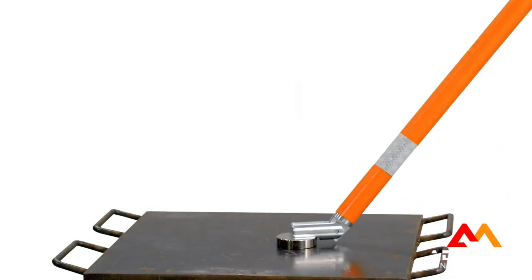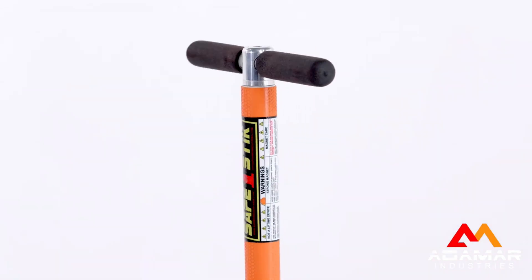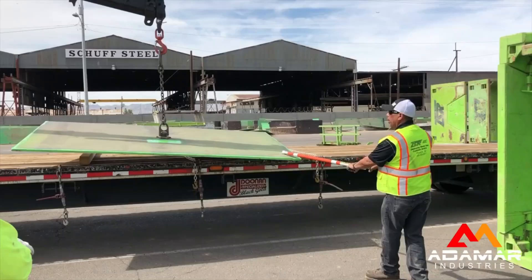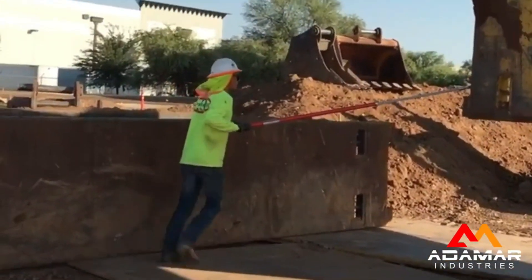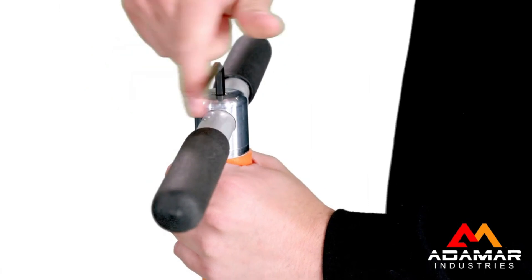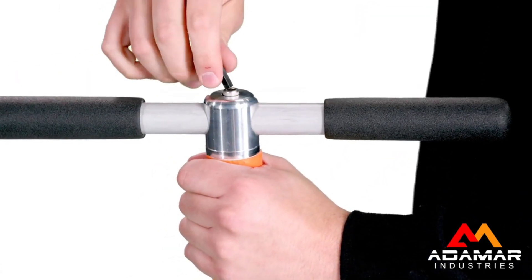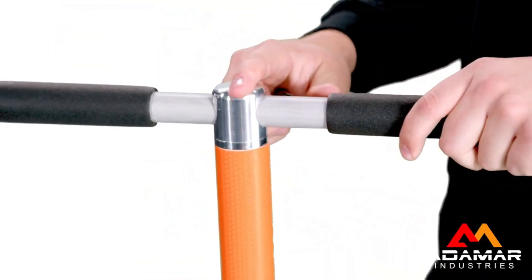The magnet spins freely, giving you the freedom to move with the load. The tool's adjustable T-handle can be rotated 90 degrees to maintain a comfortable grip when attaching the tool to horizontal or vertical surfaces. To rotate the T-handle, use an Allen wrench to loosen the bolt slightly. Lift up and rotate 90 degrees until the locking stud falls into place, then tighten the bolt securely.